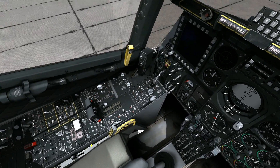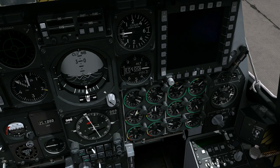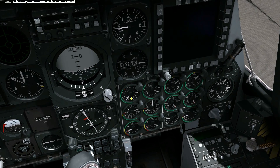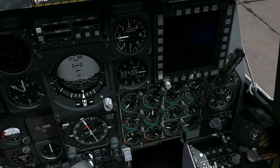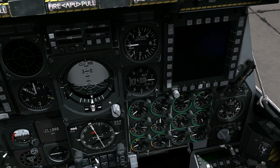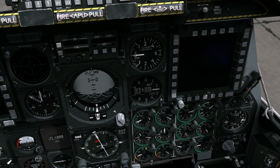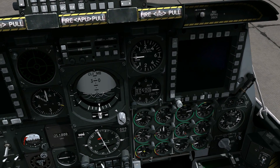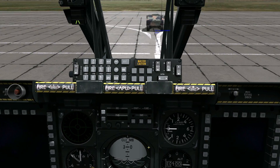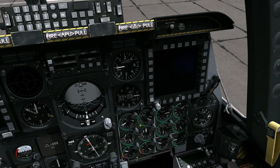Now we're ready to go — the fuel switches are on. Starting engine one: bring it forwards over the detent and it should start the automatic procedure. The automatic procedure should see the RPM rise followed by the EGT surging up a bit. There we go, up to 650 and then starting to reduce, and the oil pressure coming up as well. If the oil pressure doesn't come up then we've got to look at shutting down the engine. Waiting for the RPM to get to 62% shows a stable start. That's just to indicate we're passing the threshold for the AC generator warning.